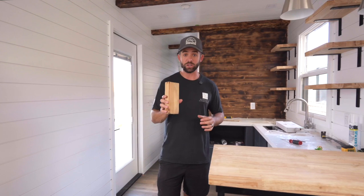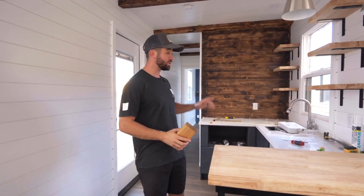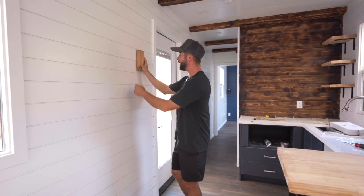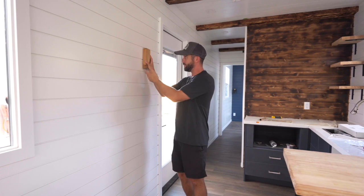It's a lot easier. Your walls are a lot sturdier, especially when you get to the partition walls. And it just has a domino effect of making your future trades after that a lot simpler. So your electrical, your insulation, even when it comes to how you attach your wires. You know, usually you want to have your wires inset off the wall. Well, when you only have 1.5 inches, there's not a whole lot of insetting you can do on wires. Same with water lines for your plumbing. Even running your drain lines gets pretty interesting.